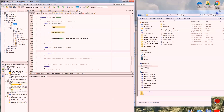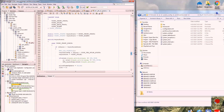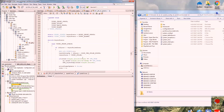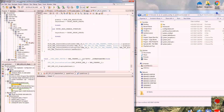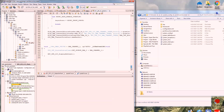In the framework folder there are two things: graphics and system. System is your clock, device controller, and your ports. Here's where the magic happens. There's a driver — the low cost controllerless driver — which has one file in it. This is what executes from the interrupt. It does the LCD display refresh — it's basically a state machine with four DMA transfers: the back porch, the active pixels, the front porch, and the H-sync pulse. During the front and back porch it doesn't put any actual data onto the data lines because there's no visible image there.